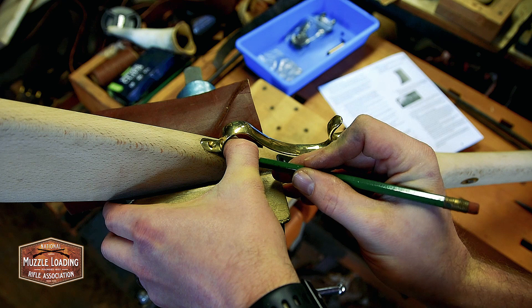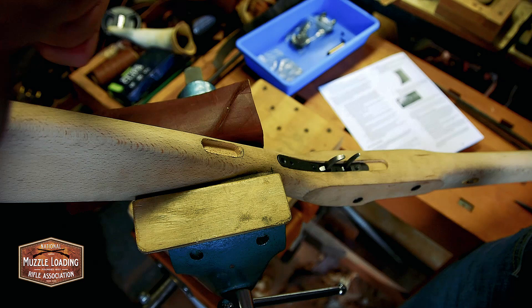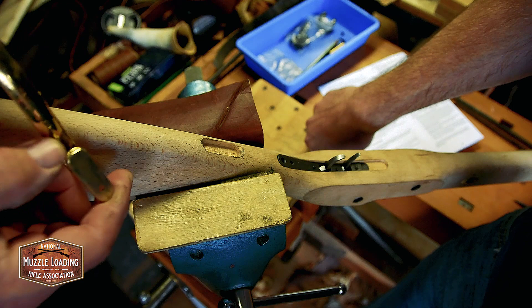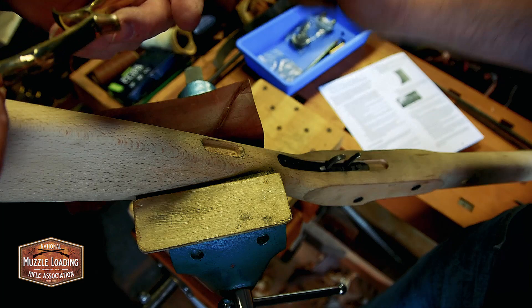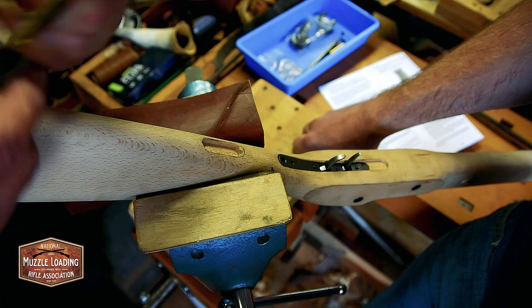The first thing I would do is get a nice radius on the front of that instead — it's kind of cobbed the way it is. Same thing with the rear — see that? It's got that mold mark. Get a nice radius filed on there and get that mold flashing out of there, so you got that cleaned up nice. I'd do the same thing up here too — get the trigger guard all cleaned up. Then I would just do that and see where you are before you do anything else.